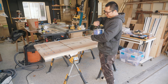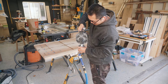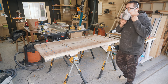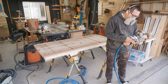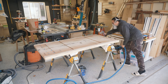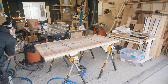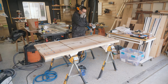The finish I'm using is General Finishes High Performance Polyurethane in flat, and I'm spraying it with a Fuji HVLP sprayer borrowed from a friend. I really like it — it's easy to use and easy to clean, so it's slowly growing on me. I'm spraying with my garage door open for more space and to avoid overspray on my workbench or table saw. It's not ideal but it's what's working for me so far.